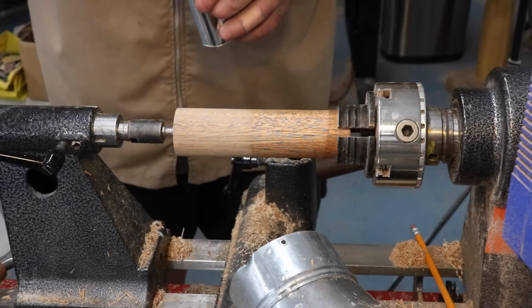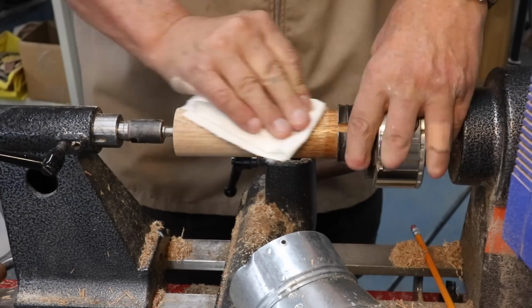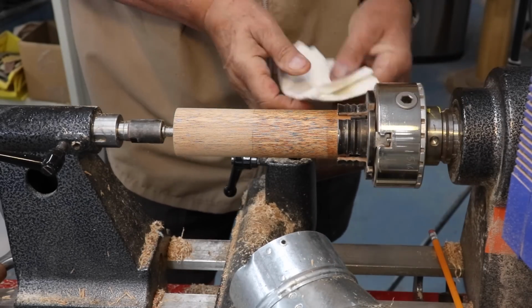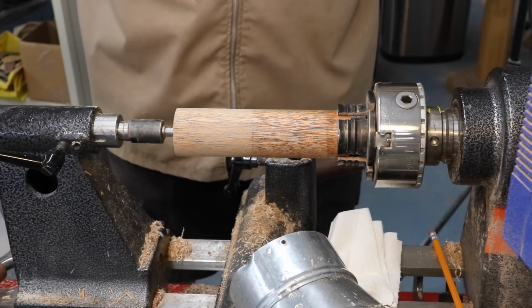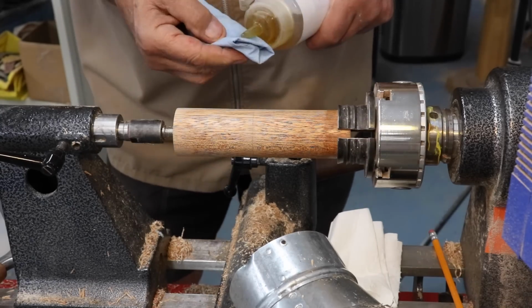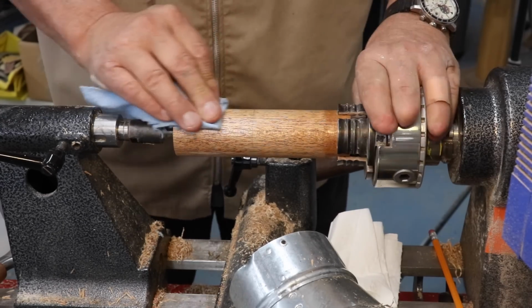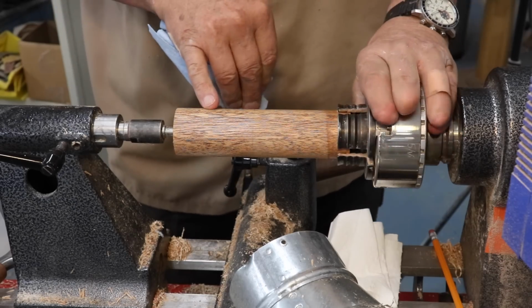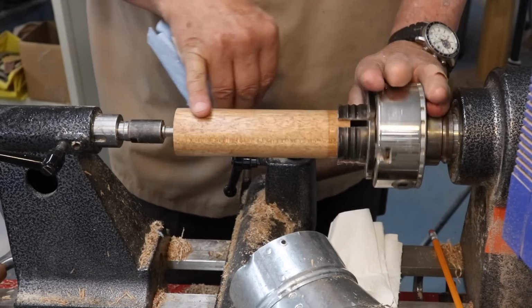It doesn't look like it's building up very well there. Make sure I don't have any of those circular scratches. Okay, and that's supposed to be really high gloss stuff. So let me go to my other homemade mixture, and I probably need to shake this up a little bit. Now, just looking at this first application of my own mixture, this side with my own formulation of lacquer friction polish looks better than this side over here. Huh? What does that tell you?